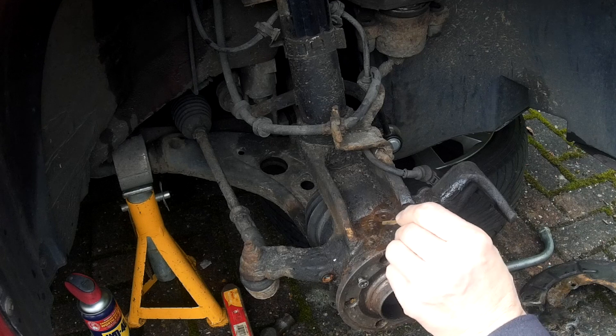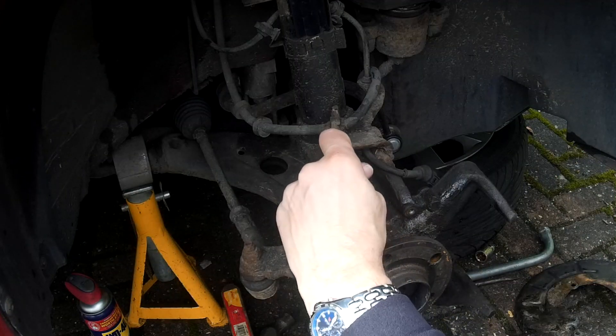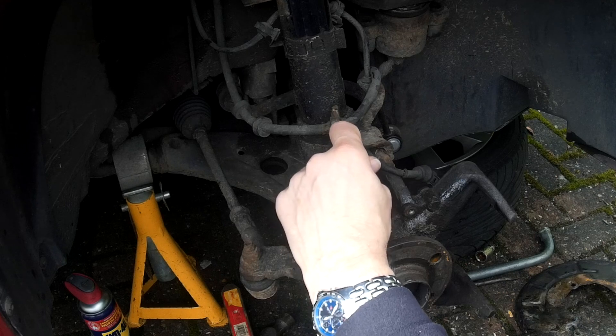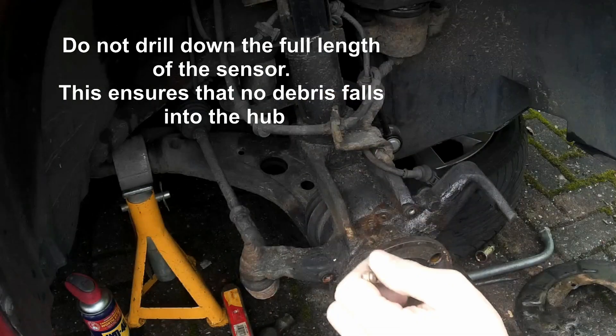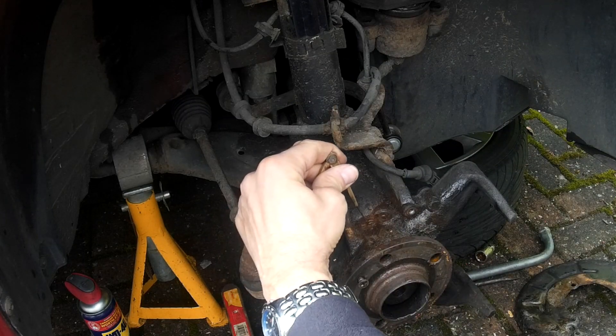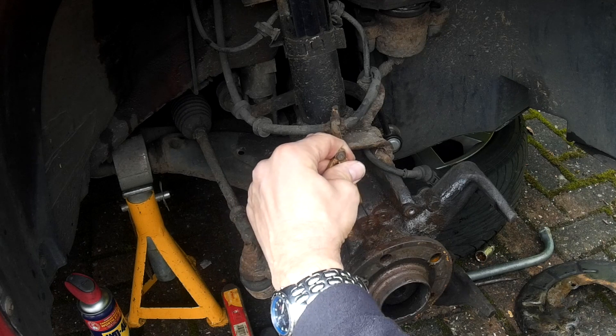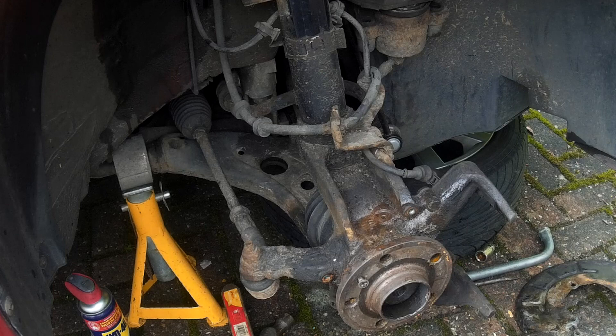What I am proposing to do is drill round the outside, but not all the way — you have got to watch the depth of course. I am going to drill round the outside and then grab some pliers and try and wiggle it and pull it out. So you take all the friction away from the outside — that is what is stopping it.